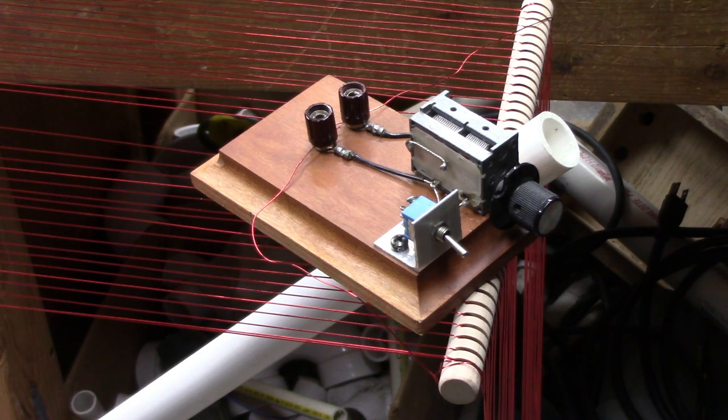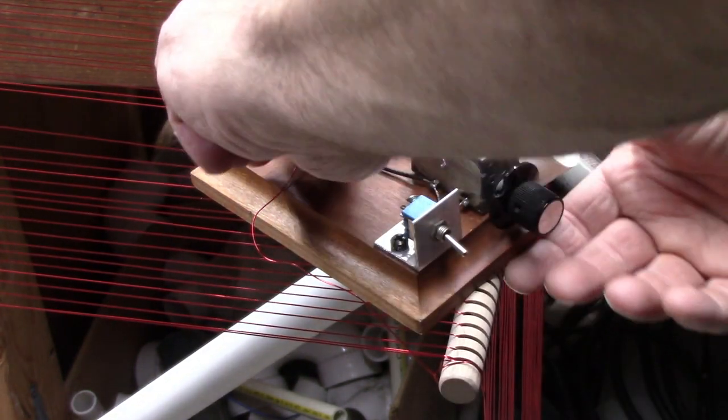Now I'm going to start removing turns, and I'll do the top and the bottom of the band again. So if somebody could, it would be really nice, because I don't want to keep stopping and writing this stuff down, but I'm going to take off 2 turns from each side. So what was our bottom again? Our bottom was 150 and 660. So that's 4 times the frequency range. All right, I'm going to put you on pause. I'm going to take off 2 turns from each side. I'll show a little bit of that.